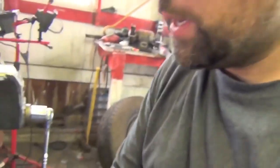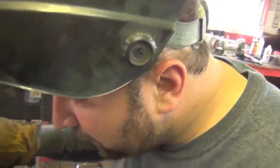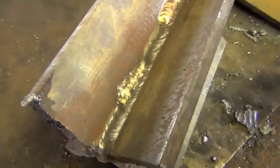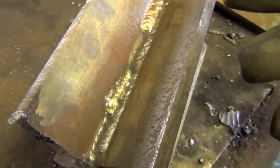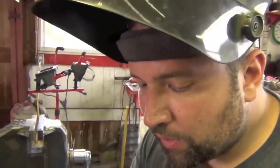Alright. So on this one, you will not win the beauty contest. The aluminum makes it flow really nice. Okay. But the looks of it vary also with how much you preheat your casting. This was a pretty cold piece of metal here. We didn't preheat anything, so it didn't flow quite as nice as pictured. But on a casting often enough, if you get it done, if it sticks together, you're in business. Looks are kind of secondary. To get the casting done is the top priority.